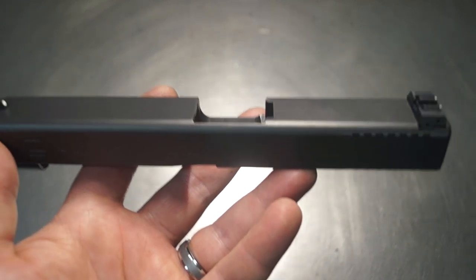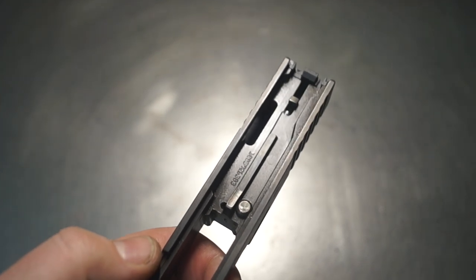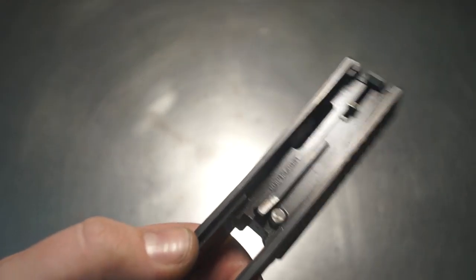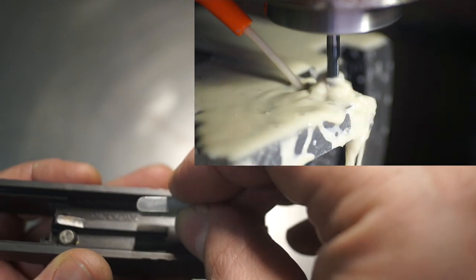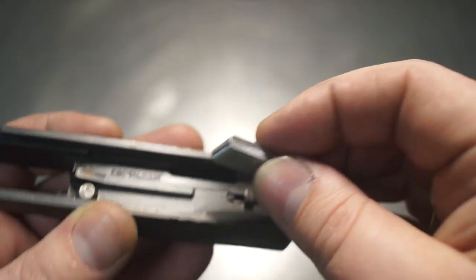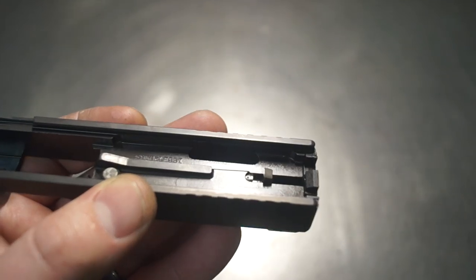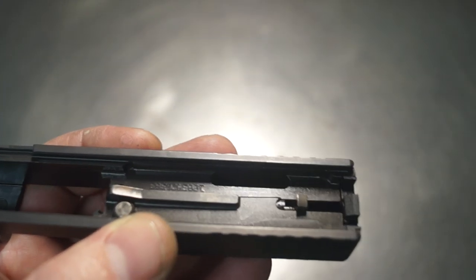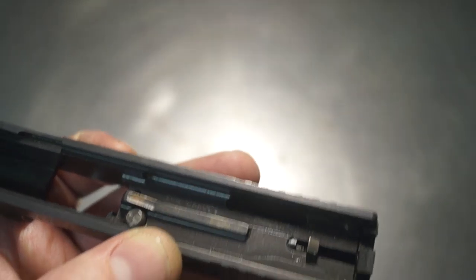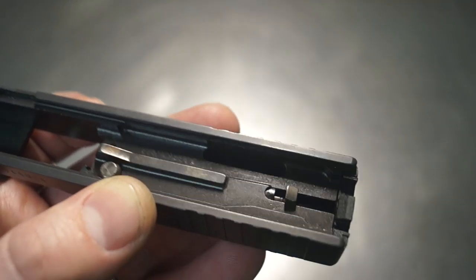Now that you get the feel of the work, how are we going to go about fixing this hole? First and foremost we're going to strip the slide down raw, take all the parts out, and sandblast that hole — we want to make sure it's clean with no oils or grime in there. Then we've created a wedged plate. This little plate is tapered — one side is actually a little bit wider than the other. It slips in and gets forced all the way down. We will still use an epoxy to make sure there are no gaps, because the hole isn't tapered and the plug is, so there'll be a little bit of a gap inside. We want a nice even seal all the way around.